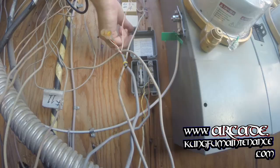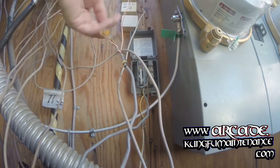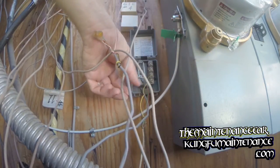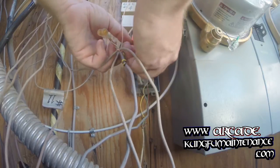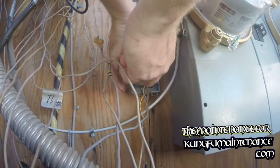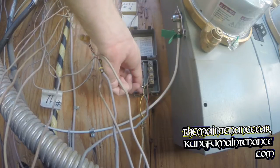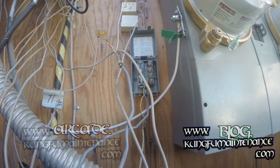I have a little trouble with my gate — no dial tone at the gate. So I'm going to test it here. I have a little tester device; I pull it out and test it right here to see if I have a tone. And I do — line one. So my problem is not right here. I actually have a dial tone, and that rules this location out. I can continue to troubleshoot further down the line to see what's going on.